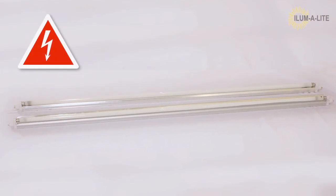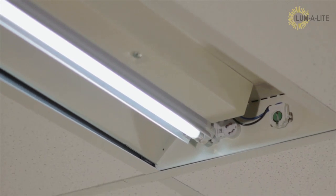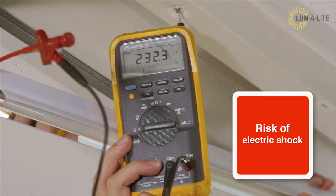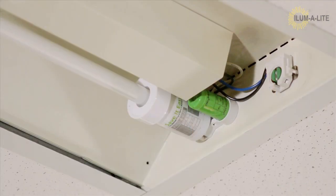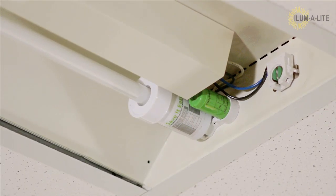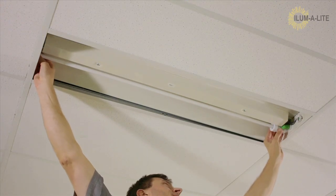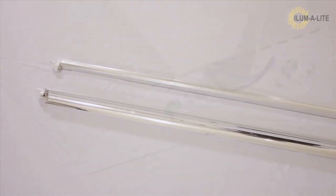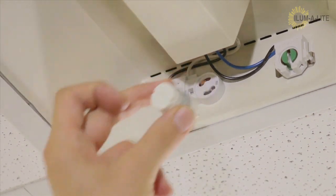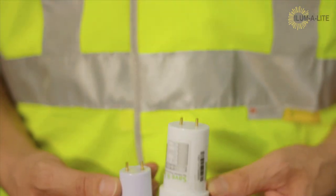There's also a possible safety hazard with both adapters. This exists because the electrical current is actually running inside the frame itself. This presents the risk of possibly exposing live contact points during installation. The Save It Easy avoids this hazard by maintaining the current path through the light fitting itself, just as it was originally designed, ensuring safety during installation. A good rule of thumb is if the adapter you're installing requires you to permanently remove the starter, then it creates this safety hazard.